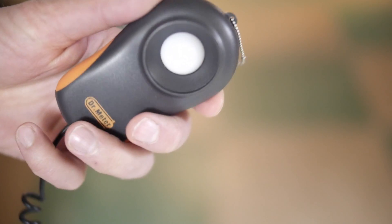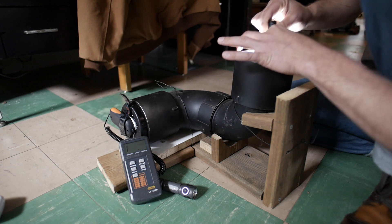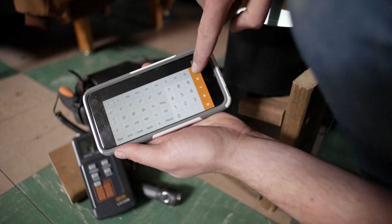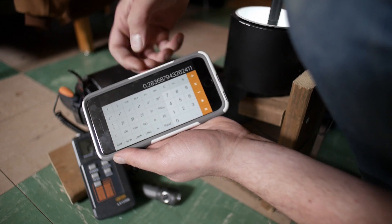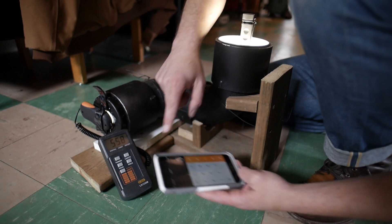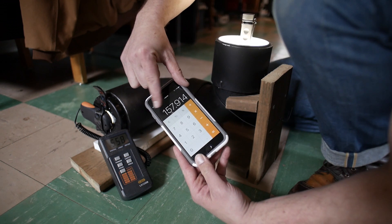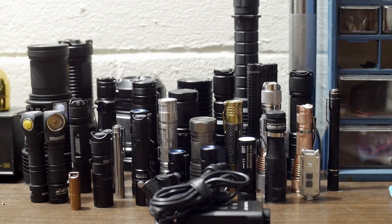You'll see multiples of 10 at the bottom - when using brighter modes you'll need to go to higher multiples. If you ever see a '1' that means you need a higher range; just hit the range button until it stops. Put the light in the dead center of the shelf, turn it on, and record the lux figure. Divide your lumens by the lux - so 8 lumens divided by 28 lux gives you your multiplier, which is in the mid 0.2 range for mine. Now you test other lights and multiply your lux reading by that multiplier. Use multiple reference lights to fine-tune your multiplier.